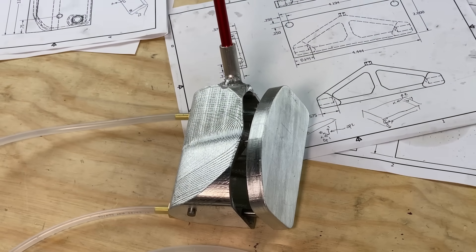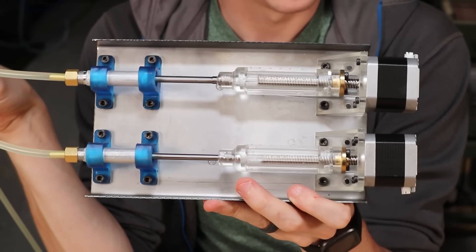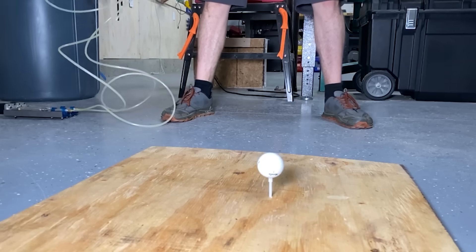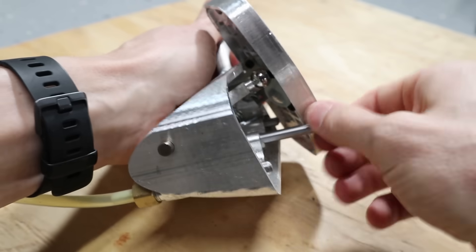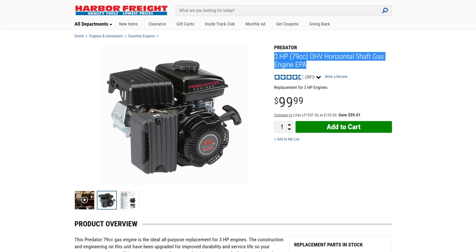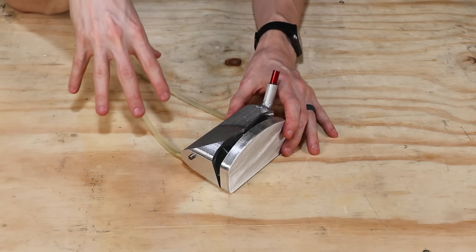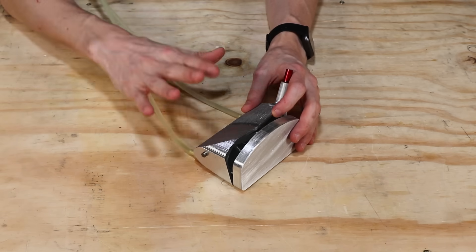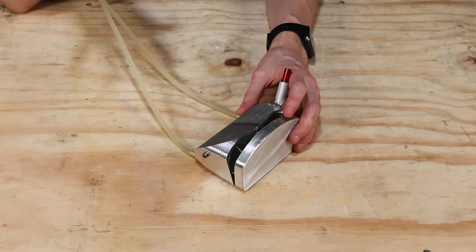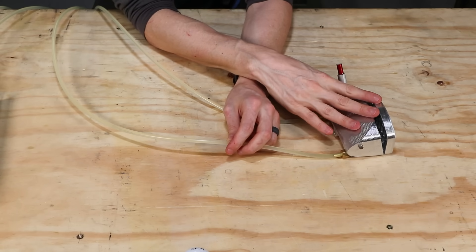I needed a way to move the face angle of the club quickly and in a way that's very stiff and can take a beating. I designed and made two little hydraulic pumps that can pump fluid through hoses. This is obviously not yet miniaturized — I'd probably be wearing this on my back. The hydraulic fluid goes through these tubes and actuates two little hydraulic cylinders built into the club. Unfortunately, this club has a pretty fatal flaw: it breaks apart every time you use it. When I ran the numbers, I saw I would basically need two of these engines to force the fluid through the hoses fast enough. Imagine trying to suck a 55-gallon milkshake through a straw in 10 seconds. So to make the system work, I bumped the size of the hoses up — and this is where I committed a terrible sin that totally perverted the design. These hoses are stretchy, very stretchy. If you pressurize them, they get longer, and that's a problem for a hydraulic system where I'm generating high pressures and need it to not move.